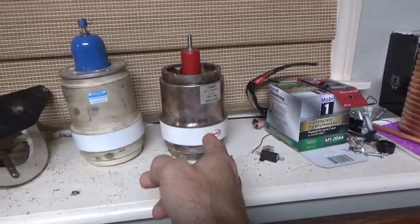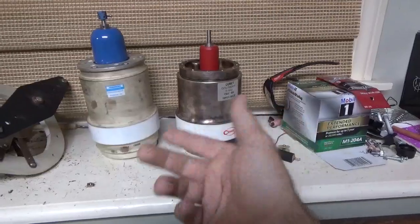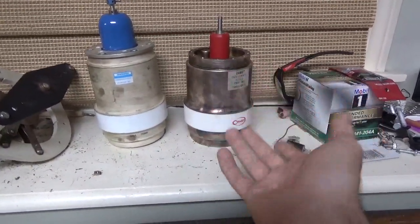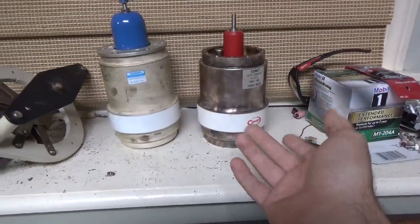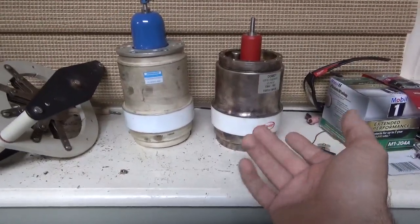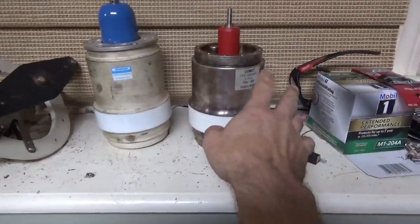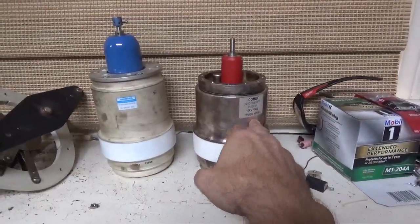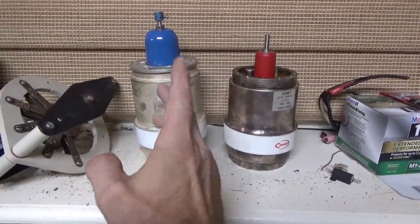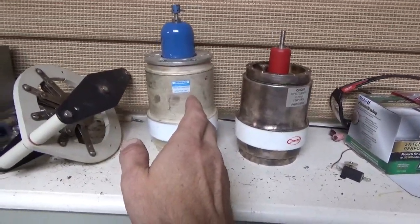So that's a Comet capacitor — I know it's a little bigger than I need. Me and Jim figured out the plate load impedance, and even 500 pF is more than I need to get down on 160 if I decide to go there. But I already have this, so it's free — I got it for nothing. It's 15/9 kV and I have a 35 to 3,000 pF cap for the load side, also enough to get down on 160 with the plate load impedance I'll have.